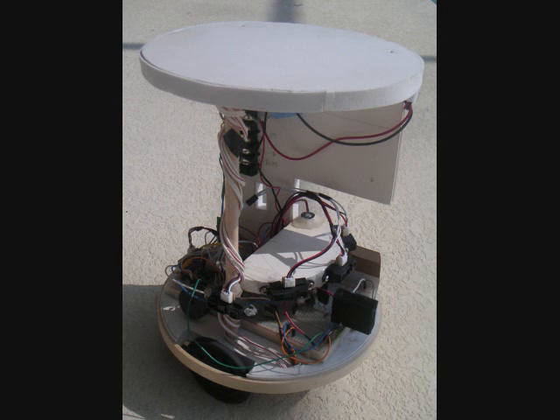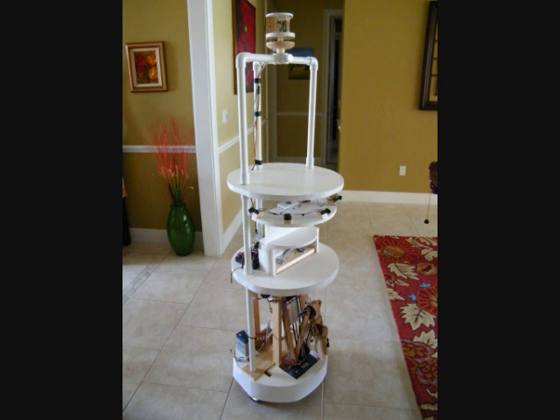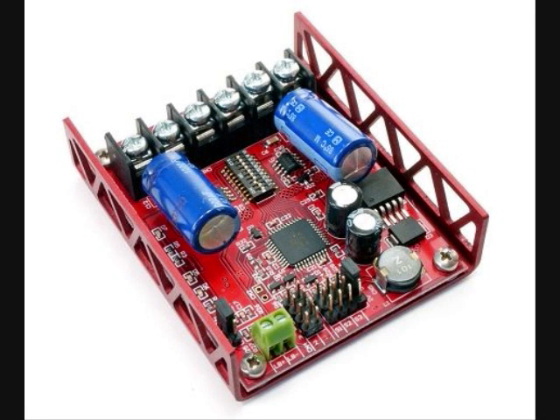The motors on this small DC robot take less than an amp, so they can be driven directly from the ROS chip. The servo motors used on this robot are also driven directly from the ROS chip. The man-sized robot needs much larger motors — too large to be driven by the small ROS chip. In those cases, we have a solution: when large motors are needed, the ROS chip can talk to a Roboclaw and drive motors up to 30 amps each.